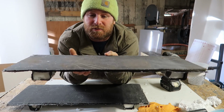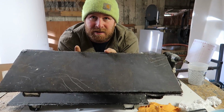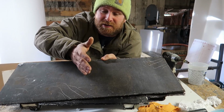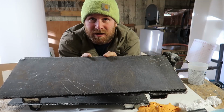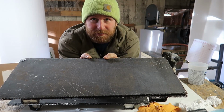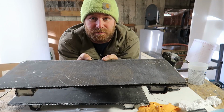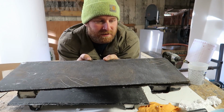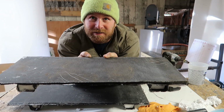He also told me a couple cool little things about this material, that the structure is actually 2 directions, 0 and 90. So that means that when I do my layups, I only need to do 2 directions, 0 and 45, to get what I want, which extremely simplifies the process of laying up the carbon fiber, which is great news too. And I'm really excited.